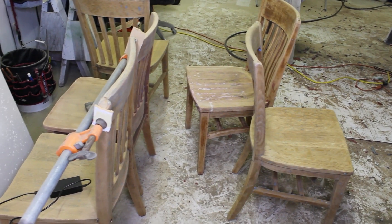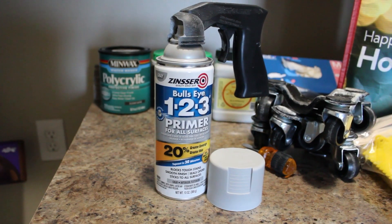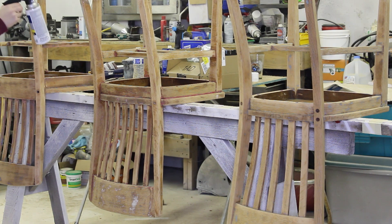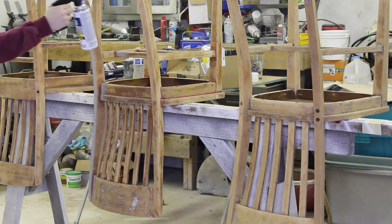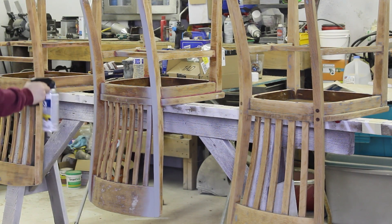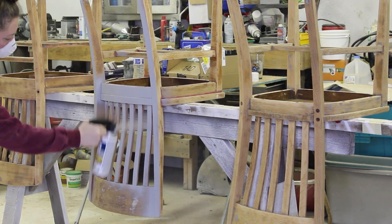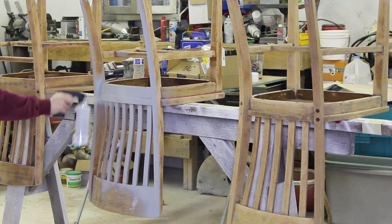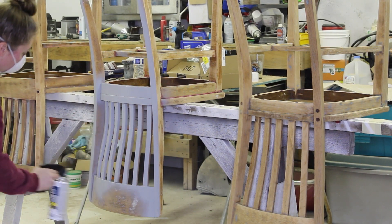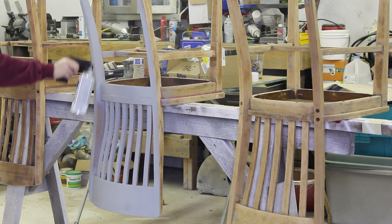And what felt like 500 hours later, all five chairs are completely stripped and I can finally move on to priming them. I used the Zinsser Bullseye 123 Primer in the gray color. I used the aerosol type to save my sanity and time, with a fun little spray attachment that I got off of Amazon — I would recommend that to anybody using anything in a spray can. Everything will be linked in the description. I ordered four cans and it was enough to do about one and a half coats on all five chairs.